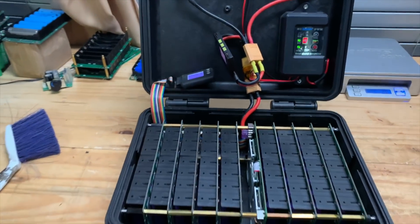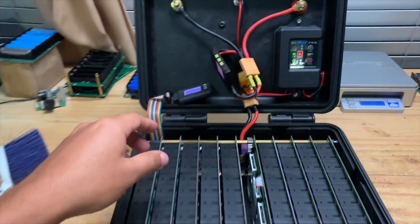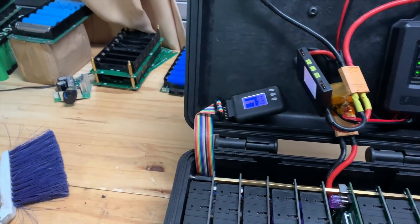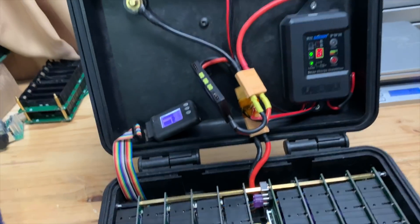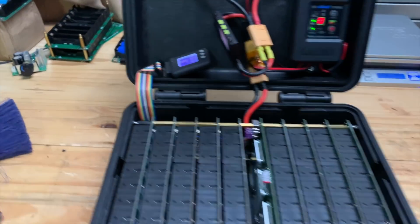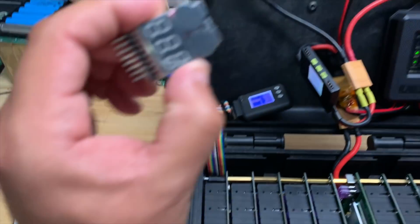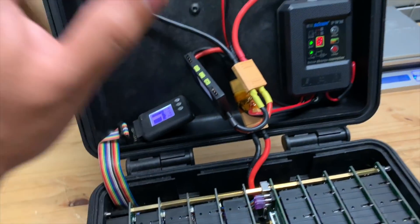Here's the answer: yes, it was the load. Many of you guys pointed out that the load was all over the place — the DC signal was dirty, and that was making these readings go all over the place. If you use these without that giant inverter I had, then it actually operates nicely. It doesn't oscillate and the voltages aren't weird. So these are still useful — I still haven't made up my mind on whether I'll use them.